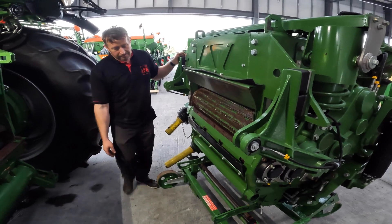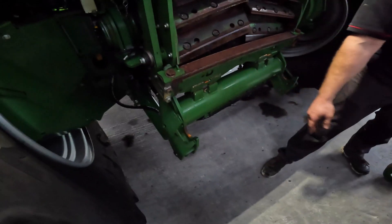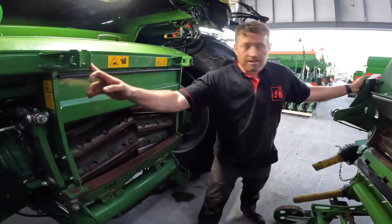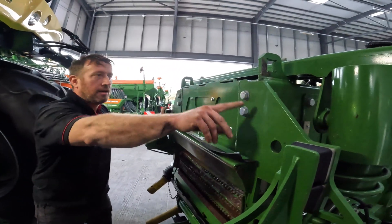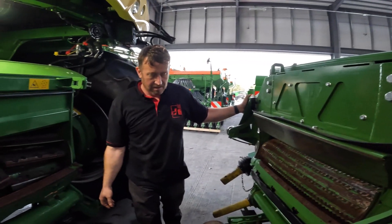So I'm going to try and line up the feed rollers. You can see this part here — it lines up with this hook here. I'm going to have to start the machine in a minute to line them up. There are a couple of square pegs — you'll see them in a minute — that's what holds the machine in place.